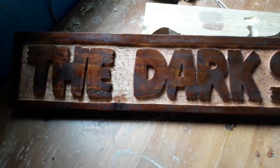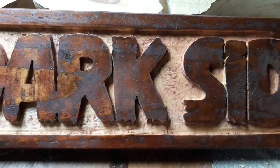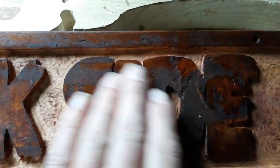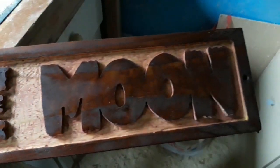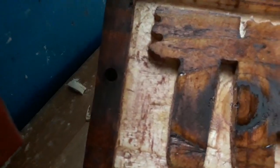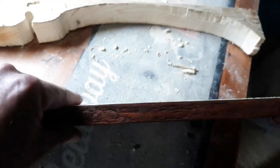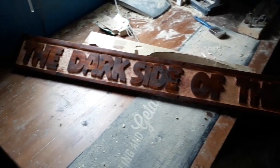That's all finished now. The stain has not come out too bad — I'll just mix a little in with the linseed oil to give it that warm look. It looks like it's burned in places but I quite like that. Because it's a fence panel it's already treated — tonalized, pressurized, whatever you want to call it — so you can put it outside without any problem. It is only cheap wood, ideal for somebody starting out and wanting to practice. I've put mounting holes in the ends and also some in the middle, because it's quite a long piece and cheap wood will want to twist and buckle, so that keeps it in place when fastened to a shed or wall. Very basic wooden plaque sign — give it a go and see how you get on. Thanks for watching.